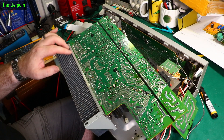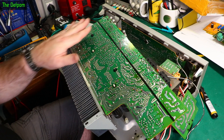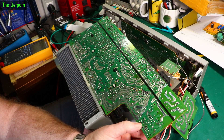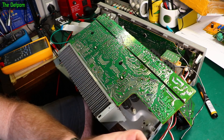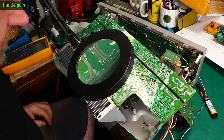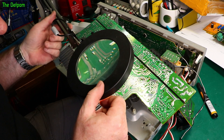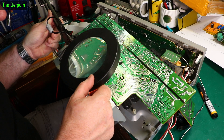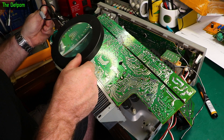This is obviously the thermal area because of the heatsink, and the actual power transistors are here — these are the most likely area to have a problem. There's a capacitor just there that's wobbling a little bit, which means it could be failing and extruding off. Within about 10 seconds of looking I've already got some bad solder joints over here — the little rings around the joints look like they're failing. Another one there is looking a bit dodgy.